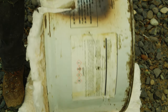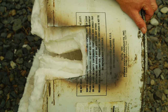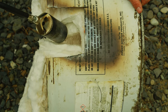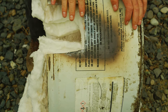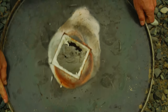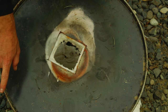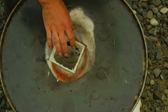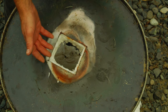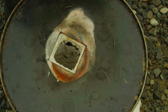After that, I had to cut a hole for the burner to go into. That's where the flame and heat come from. I made this about four inches by four inches, and I'd use the same dimensions for the flue. The flue is essential for allowing the burned vapors to escape. Otherwise, you'll wind up with a very early reduction atmosphere inside your kiln and it won't be able to get any hotter. You won't get any appreciable temperatures inside your kiln if your flue is not big enough.